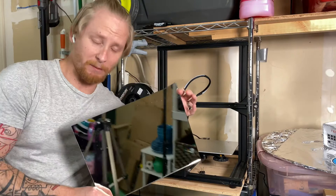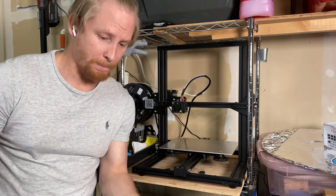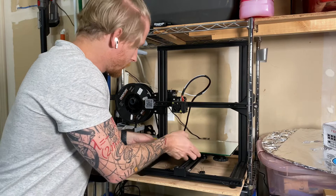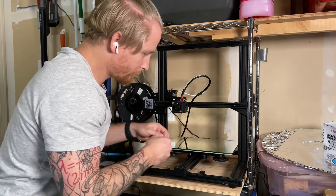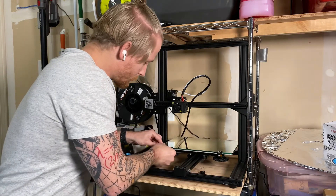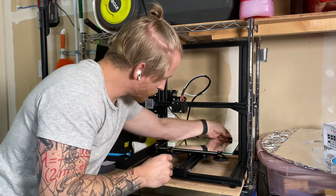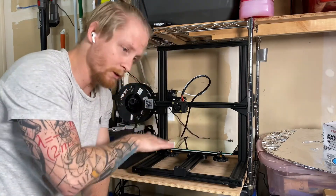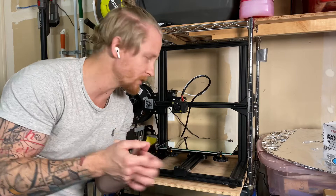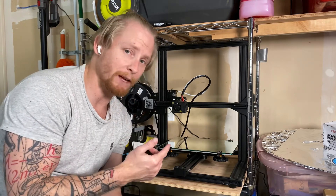I have cleaned the piece of glass and cleaned up my mess on the table, and hopefully all the little shards of glass on the floor. It's ready to install. I'm going to pop it on, then level it. I'll line that up — one, two, three, and four. It's as simple as that. I'll switch it on and heat it up. It's apparently best to do the bed leveling when it's at temperature, so any thermal expansion in the print nozzle or the bed itself can be taken into account. Let's do that and see if it prints.